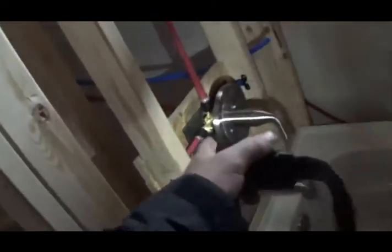This will tee off — I forgot my parts list when I went to town and kind of guessed how much I needed, so I'm short on materials. Both of those get tees — one side of the tee going over for the washer, and then the other side of the tee going over for this thing. According to the instruction manual — I looked at the pictures — 30 inches up from the drain is my mixer, 8 inches below the mixer is the diverter, and 48 inches up from the mixer is the shower arm.